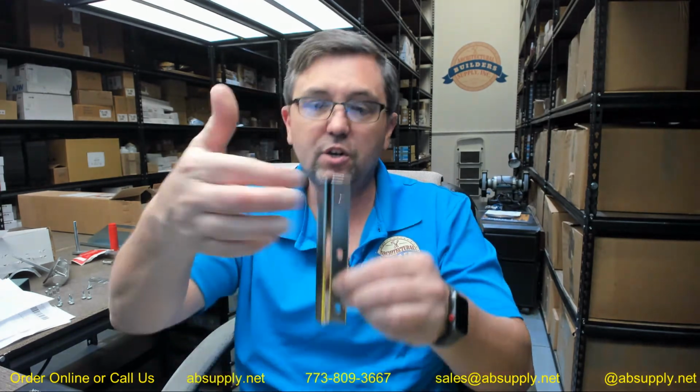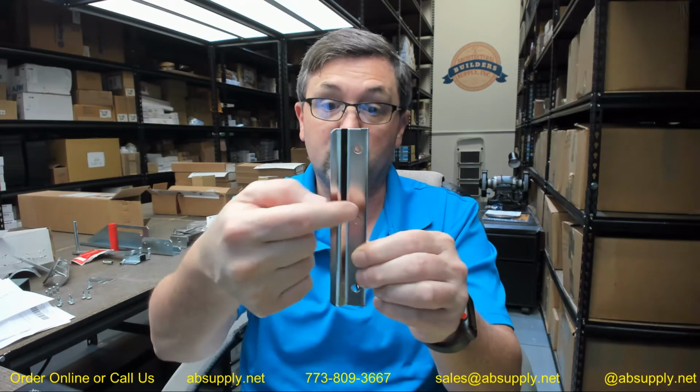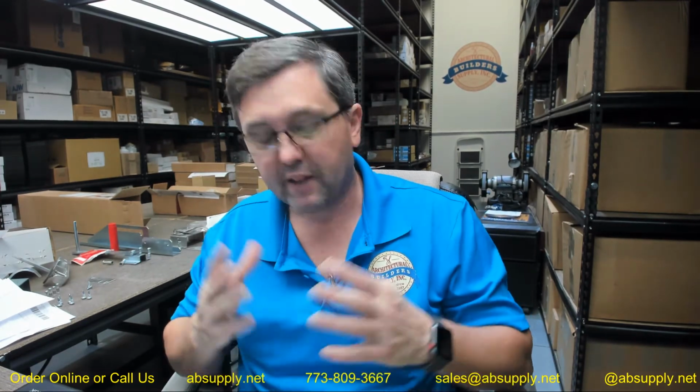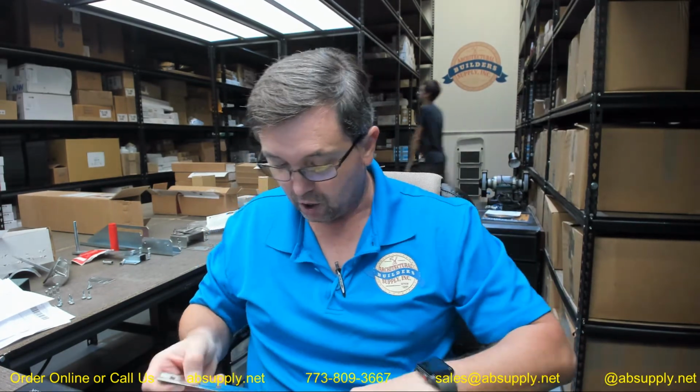So what they're saying is you don't have to install all 3. You might get away with just 1 if you've got that completely vertical. Okay, but that's why those extra fasteners are there, that's for sure. Like I said, I've installed these. They're easy to install, really easy work. So if you're a locksmith, this is a profitable service to provide, and a very valuable service to provide your client.